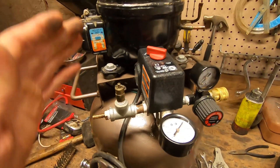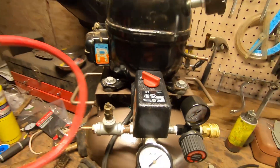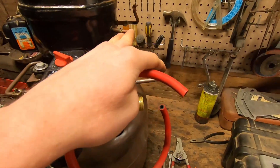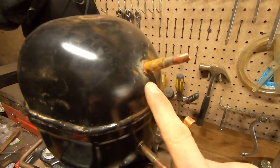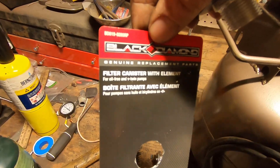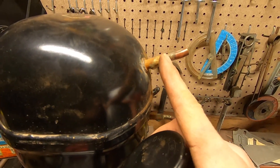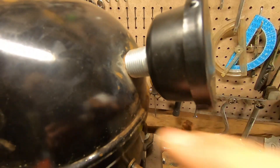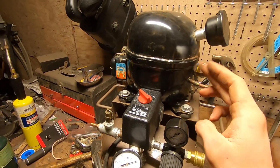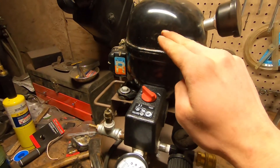We don't have air going from our compressor into our tank yet. To do that, I have this quarter-inch air hose and I'm going to connect it straight to this copper pipe and then to a quarter-inch hose barb. This is quarter-inch copper pipe and quarter-inch airline rated for 300 PSI. On the inlet, there's always going to be some kind of filter to keep the air going in clean and protect your pump. I bought a filter canister with element — basically a small air filter in a metal housing. I'm going to slip it over the top of the pipe and solder it onto the side of our compressor housing. For the air out line, we're going to put a slight upward loop in it just to make sure any oil always stays in the pump and doesn't constantly drain into our tank, which would take it away from where it's needed most and could burn out our compressor prematurely.